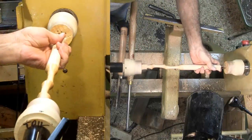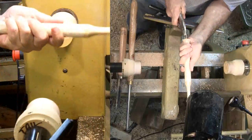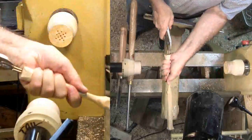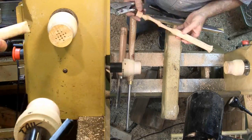Time for another transition — it's getting more routine. Pull the pins. Insert the pin in the corner hole 90 degrees from the last one; this will go in the faceplate's center hole. Second pin goes in the wand's center hole and the faceplate's offset hole. And back to the gouge.